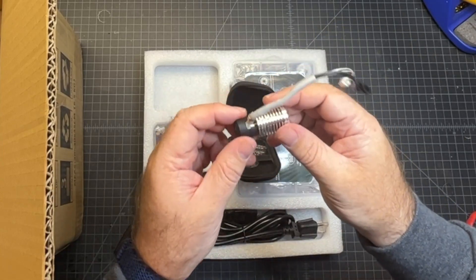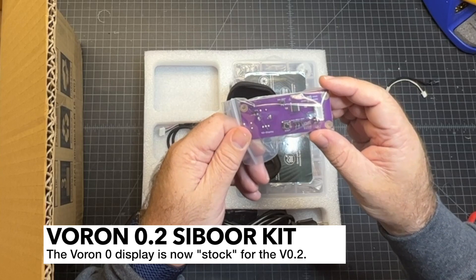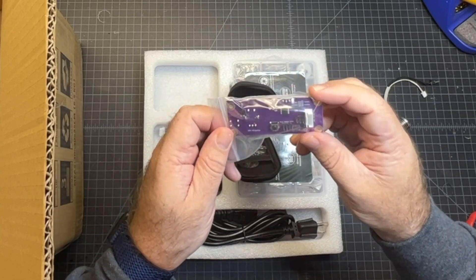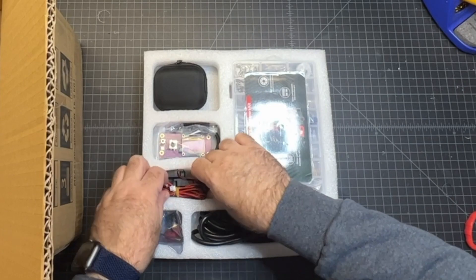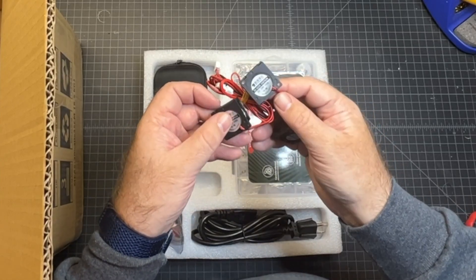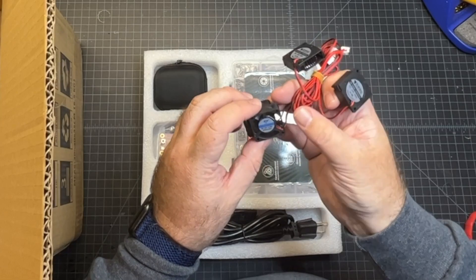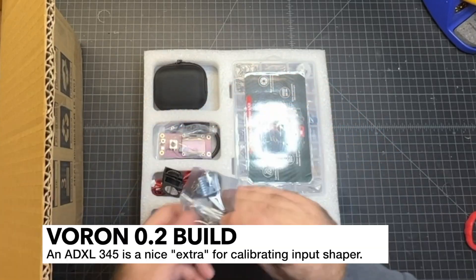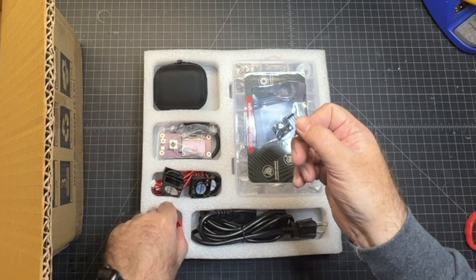These are starting to gain popularity of course with the Revo. Then we've got a Voron Zero display — it looks like it's got the USB connection. I know there's a simple display and there's the full V0 display, and this is the full V0 display. You do have to flash Klipper to it but it's a good display. We've also got our fans — 3D Geek Station is the brand, never heard of it. We've got two cooling fans and then also a generic unbranded fan, all 24 volts. You're going to use one on your hot end and one for the bottom. We've also got an ADXL345 here — this is what you're going to use for input shaper if you want to calibrate your printer to get rid of ringing and ghosting.